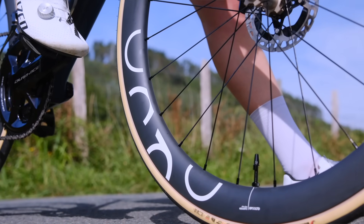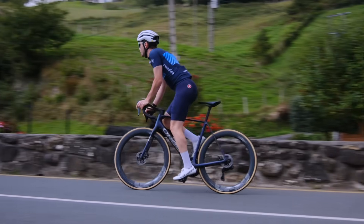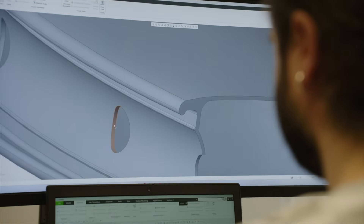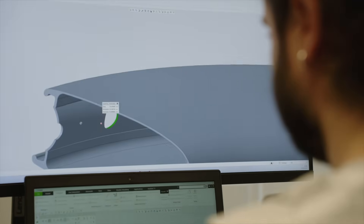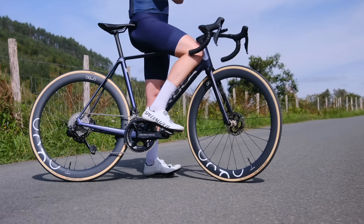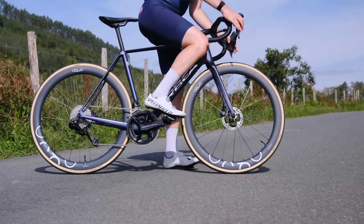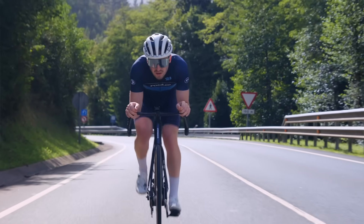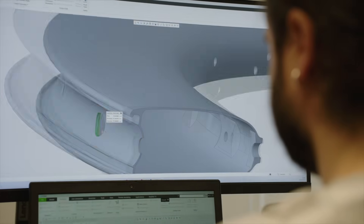Okwo also designs all of its rim shapes in-house. Does it start on the computer, as a kind of idea? Well, it starts with some ideas, but especially with a benchmark or trying to improve our sponsored riders' performance, because we are fully performance-driven. A wheel is a system — it's the rim, the hub, the spokes. In terms of aerodynamics, the rim has the biggest impact in the wheel design. A more stable product will keep the rider permanently in an aero position. We saw the opportunity, working together with the tires, to improve our crosswind effect and the thrust that could be created at 10 or 15 yaw angles.